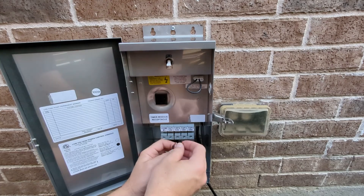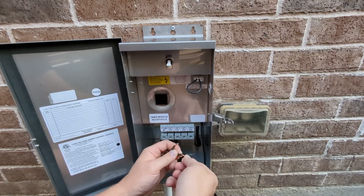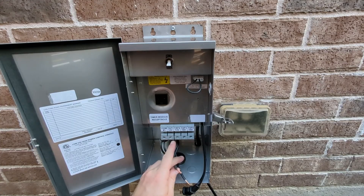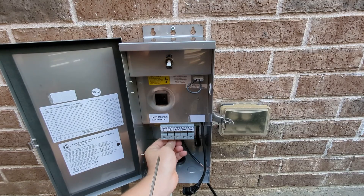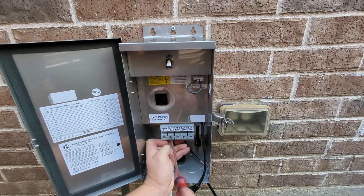So we'll say that the left side of the house is closer to the transformer. Because it's closer, we don't need as much power going to those lights, so we're going to put that in the 12 volt tap. For the far side — the right side — we're going to put that in the 13 volt tap. The 14 and 15 volt taps are for runs of 150 feet or further.